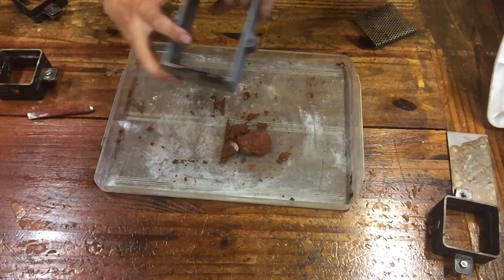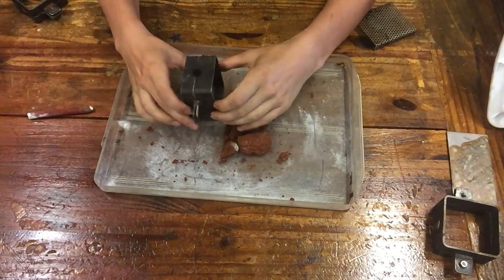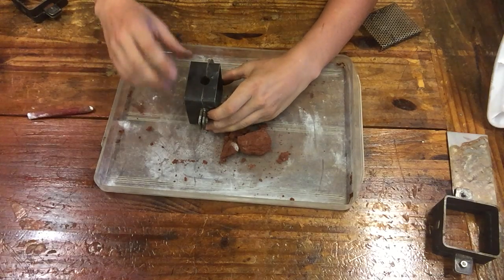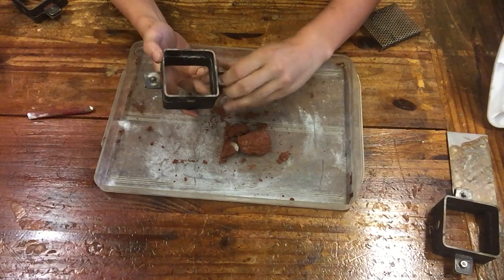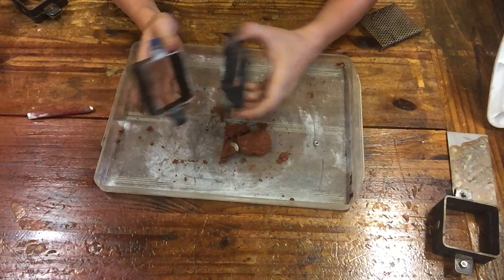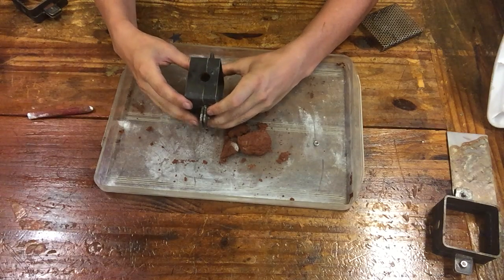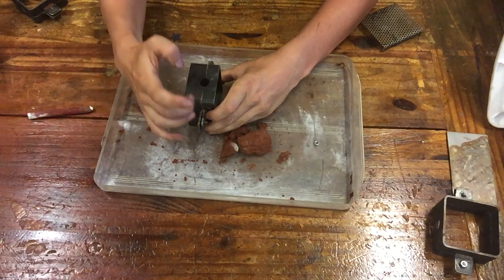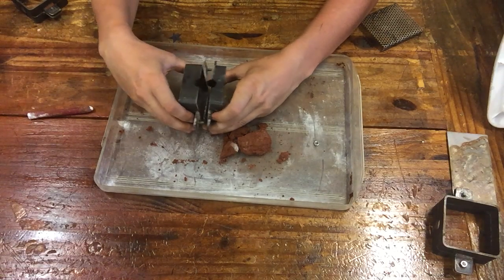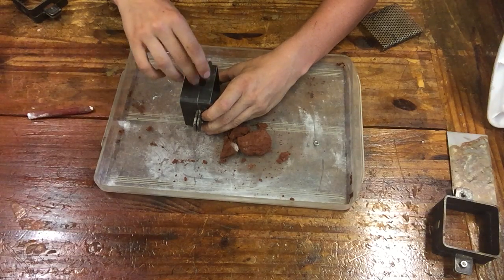What I would recommend — these are custom fabricated, but they're very cheap to make. It's just a piece of box tubing sliced in half and then bolted back together with wing flanges. This allows you to take your mold frame apart and decide whether you want to pour through the top hole. Just bolt the wings back together. When you're fabricating it, it's a cut seam and you drill a hole. I tend to countersink the holes so when I pull it apart, my sprue button isn't going to bond strongly to that junction.